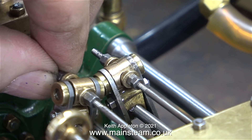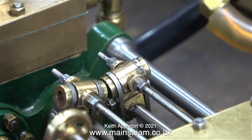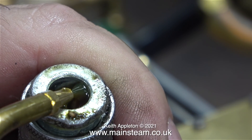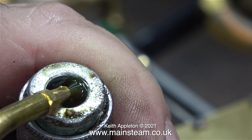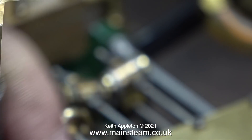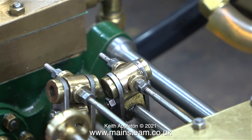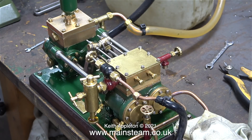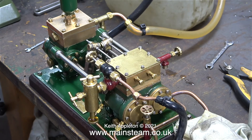This is quite a short video because most of it consisted of me with my great big hands adjusting these nuts back and forth. Here you see the final setting — time for a bit more oil in the air fitting, as steam engine cylinder lubrication is essential. These nuts have not been tightened hard up against the levers; there needs to be a little bit of end float.